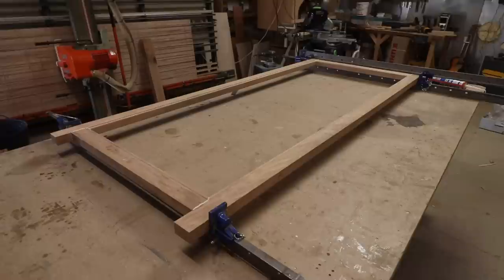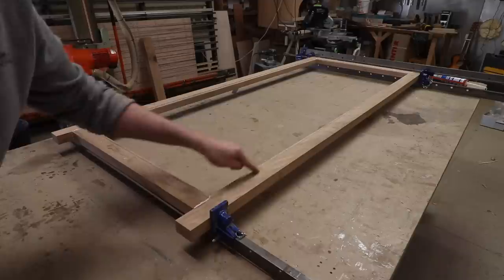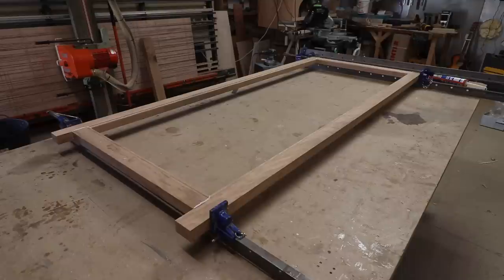So if you put that clamp slightly nearer the inside of that rail, it will actually bend that piece of wood slightly inward. So if you then try to square off that part, you're not getting an accurate reading. Now that we know it's square,